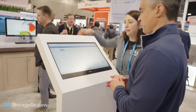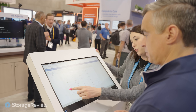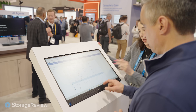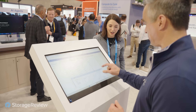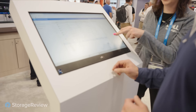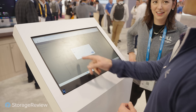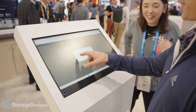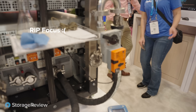Then we've got to reopen the valve — we do that through the IRC device configuration. We see valve one. Hit action. You can see all the information. Open it up — there's an apply button too. Hit open, hit apply — and look at that, back in business.